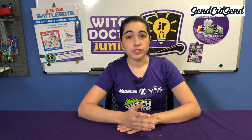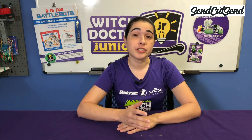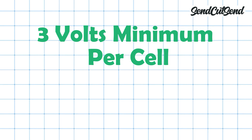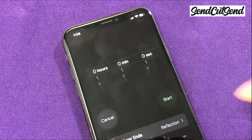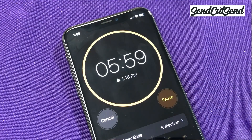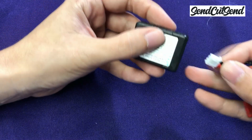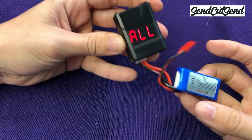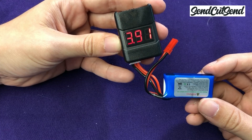It's important not to damage your LiPo batteries by overcharging them, over-discharging them, overheating them, or crushing or piercing them. Since you can damage your LiPo battery by discharging it too far, it's important while you're practicing driving that you don't drive your robot until it stops moving from a depleted battery. Each cell should be no lower than 3V — since you're using a 2-cell battery, the total battery voltage should be no lower than 6V. You can check this with your voltmeter. One way to make sure you don't discharge your battery too far is to set a timer when you practice driving at home. We calculated that your battery should last at least 6 minutes, so you can set your timer to 6 minutes. You can also buy a low voltage alarm that will display the voltage and sound an alarm when it's time to recharge. Fingertech sells these, or you can buy them from a local hobby shop — they're very inexpensive and can save your battery. Just make sure not to leave the voltage alarm in your robot for the competition, since it would add weight.